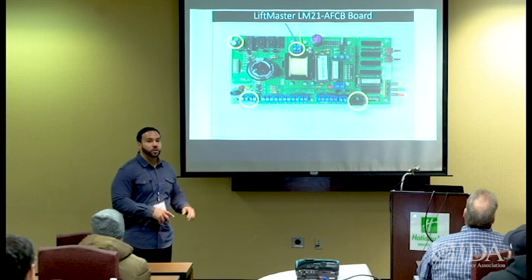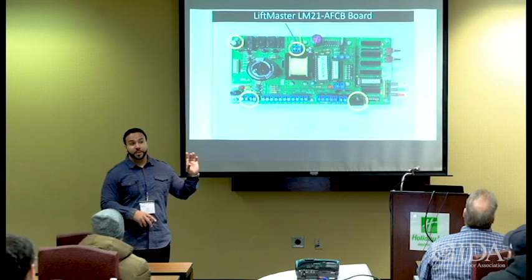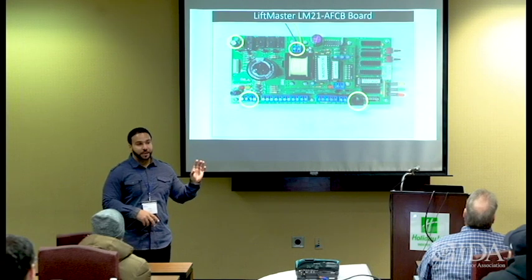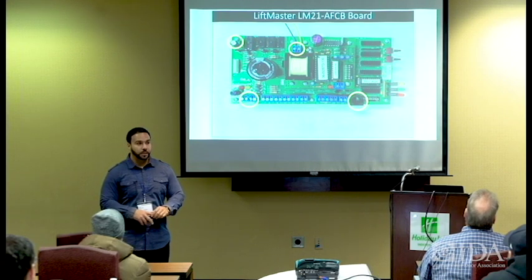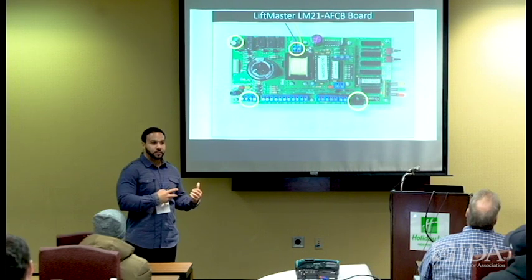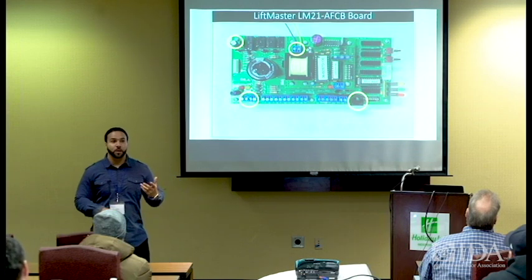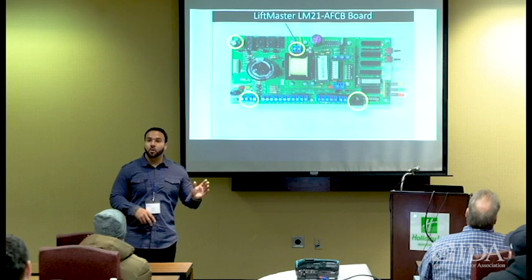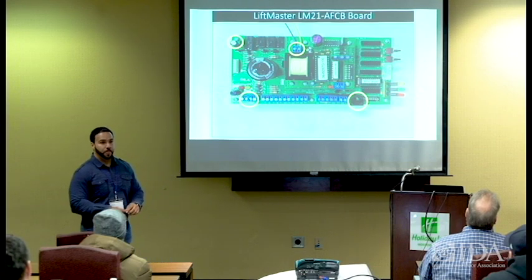These particular units will not take a normally open though. The FDOB will. It has a dip switch setting that allows you to change that. These units have to have a normally closed, okay? C-form dry contact from the building alarm panel or a smoke detector through a relay module interface that comes back to the unit, and then when it changes state from closed to open, sends the signal through the circuitry to gravity drop or motor close the door, okay?